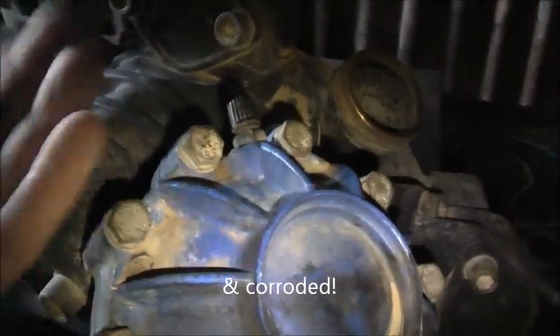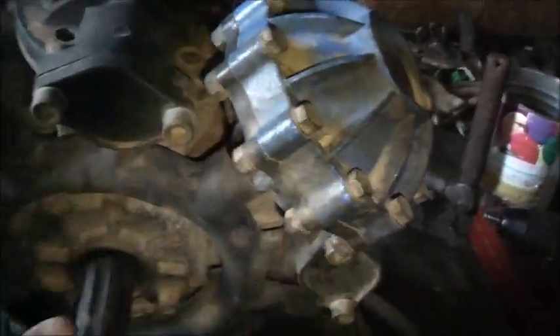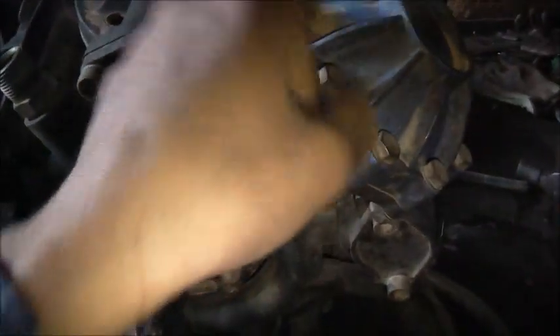So that's actually a Bertolini pump. That's another Bertolini pump there — a very old model from the late 70s, very worn out. That's the air bladder. It has a diaphragm in there, a disc, a cup. And that keeps the output of the pump smooth instead of it fluctuating. If it fluctuates, you know that air bladder's gone.